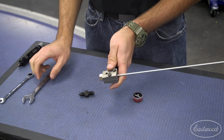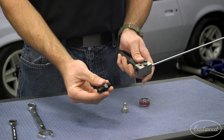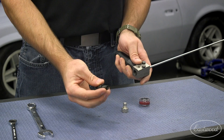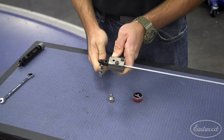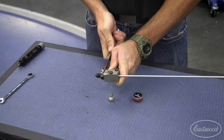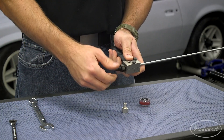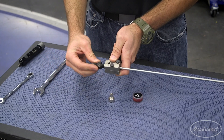The last two steps are easily carried out with the Operation One and Two combination die from this kit. It's clearly marked to eliminate any confusion. Simply insert the OP-1 into the front of the die blocks and begin to tighten with your wrench until it bottoms out in the threads. Backing this out will allow you to flip the die over and repeat the process to create the perfect 3/16ths SAE double flare.